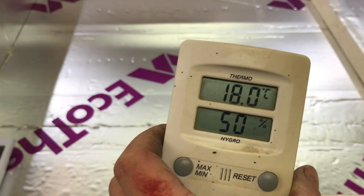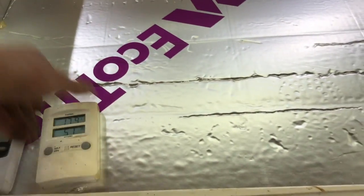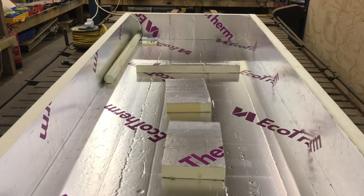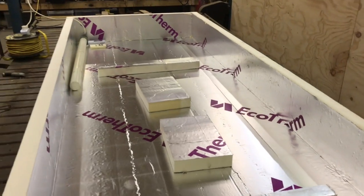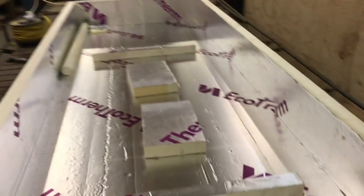I'll put one of these in to check humidity — it wants to be around 20°C and about 50% humidity. You can just put the lid on and rest it on once we get the wood and the resin in there. Then hopefully give that a slow bake overnight, and that's going to get the reaction up to 30°C, which will de-gas it automatically and it should be a nice clear pour.